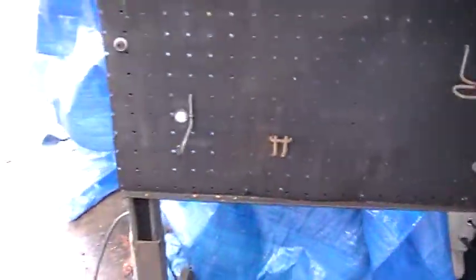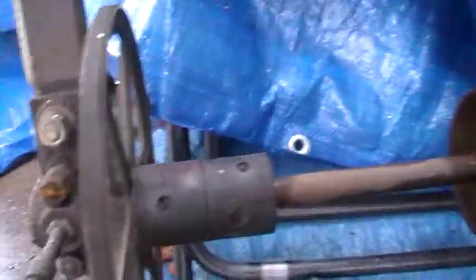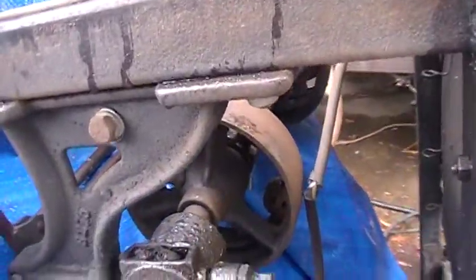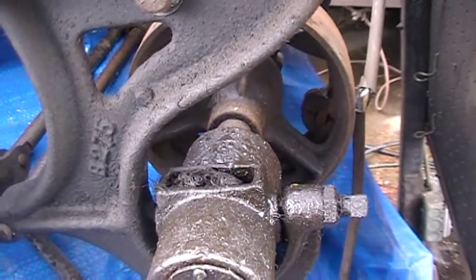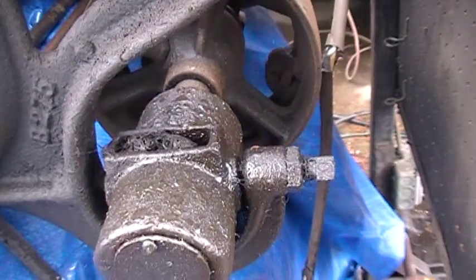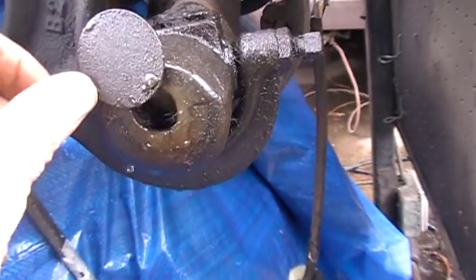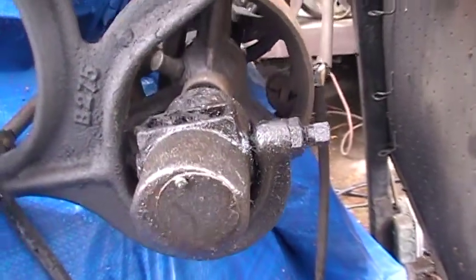Got a little one-horse motor on here. He mounted the bearing sideways, so he put grease cups on them — a great way to do it. These up here, I can see they're earlier; they have the cotton packing in there to soak up the oil so it keeps your bearings lubricated. I haven't seen anything like that — a little cover for the end of the bearing.